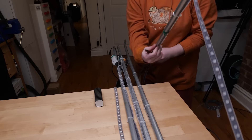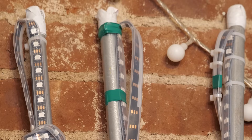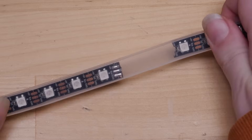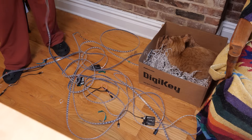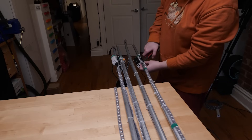The LEDs affixed to the poles had no issues, but the long tails took some damage along their lengths, as well as at the transition from the pole to the free-hanging LED strip. The silicone sheathing is more stretchy than the pixel strip, so when the whole thing was pulled, the strip inside pulled apart before the silicone was done stretching. At the tops of the poles, my attempt to soften the strip's transition by adding a stiff zip tie tail to the joint seems to have worked well, but I shouldn't have cut the silicone sheathing to do it, because the small hole I made to insert the plastic quickly ripped open wider and weakened the whole area. I'll have a use for these lengths of LEDs in a future project or to give to my students for their annual LED Halloween costume midterm. Overall, I'm happy with how little waste this project generated.